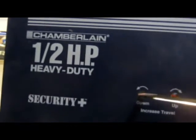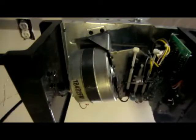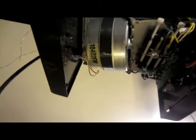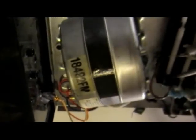Keep in mind the left one is for the door closed position. You can see the two long white rods are for the adjustment of the garage door up and down limit position. Remember, the left one is for the door closed position. We are going to use the ohmmeter on these two terminals to set up the door closed position.